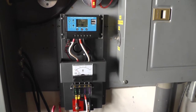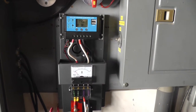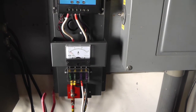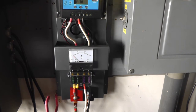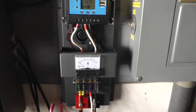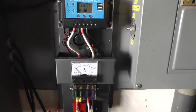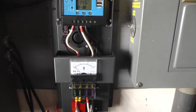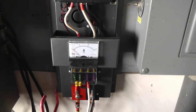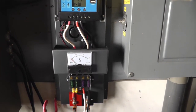It's been up there for a day working without any problems. Yesterday at one point I saw 30 amps, which I don't think I've ever seen before — I've seen like 26, but never 30. I don't know what the difference is, whether it's just not having the shunts and the extra wiring involved. But this analog meter seems to be accurate with my other meter, so I don't think that's to blame for seeing a higher reading.